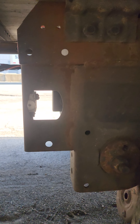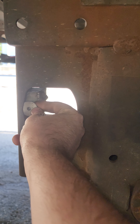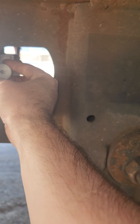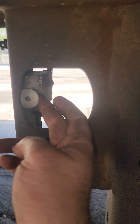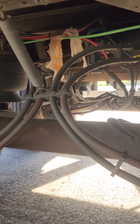Now for an air-operated trailer — over time the solenoid inside goes bad. What happens is when you pull it, it goes back in, so it plays a trick on you. Same idea: use vice grips, or you can tie a string around it and pull it out and attach something to it, or wedge a piece of wood behind it, just until you get it moved. Just don't break it — it's not made out of steel.